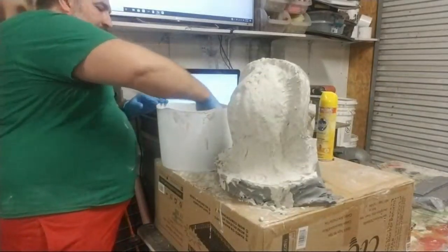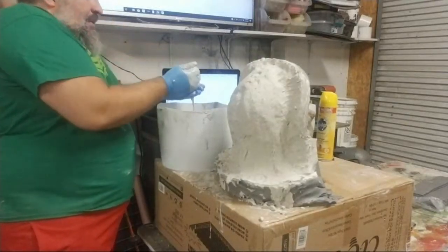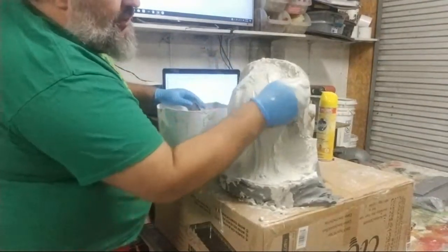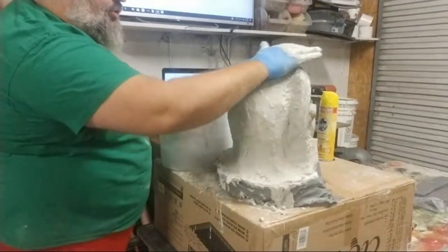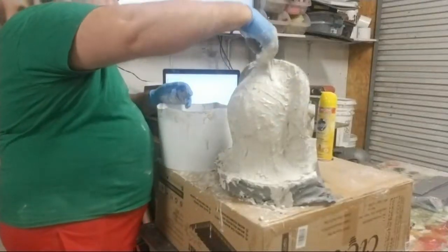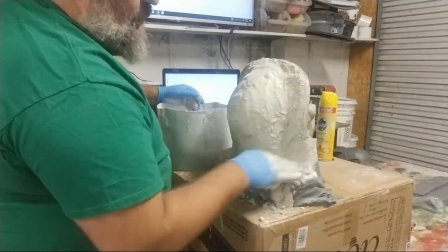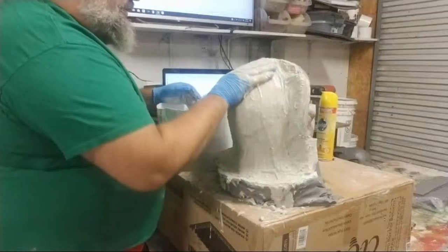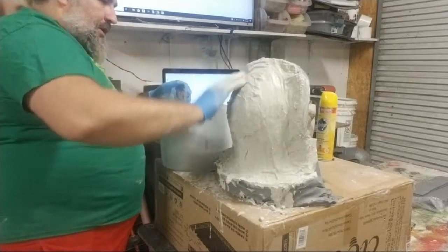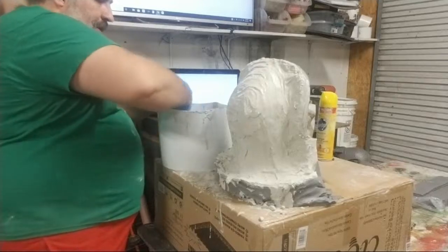Okay, I am gaining some thickness in the plaster, but I'm not quite where I want to be yet. I am able to just start putting a little bit on, and I'm introducing this almost dry plaster. It's still green, it's not even really producing a lot of heat yet. But I'm able to introduce this to wet plaster again by putting some of this wet on here. That won't be a big shock when I put completely wet plaster on here in a minute to build up thickness. And even this little bit is building up a little bit of thickness.